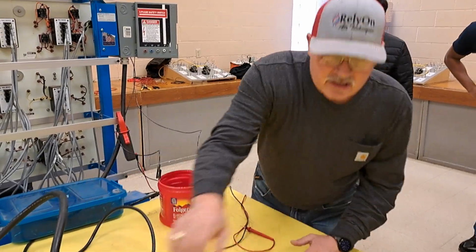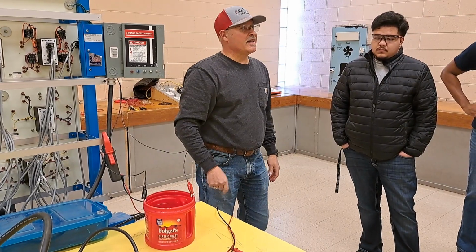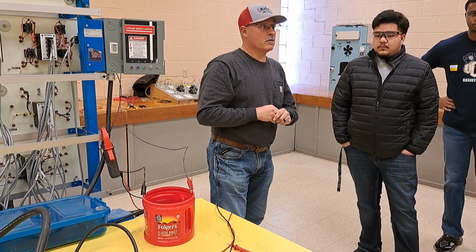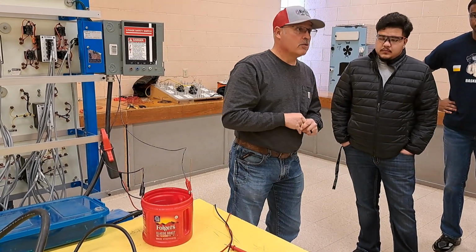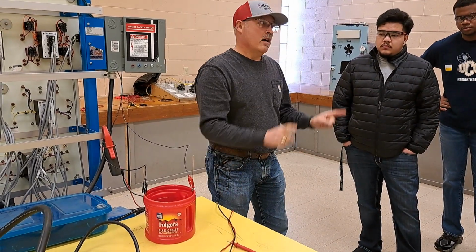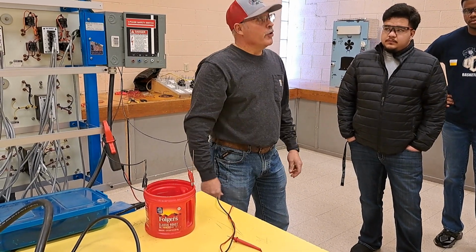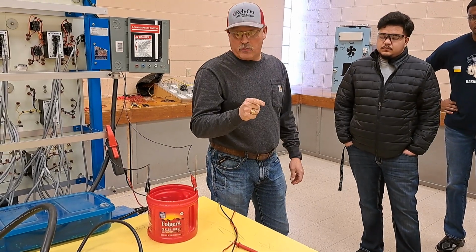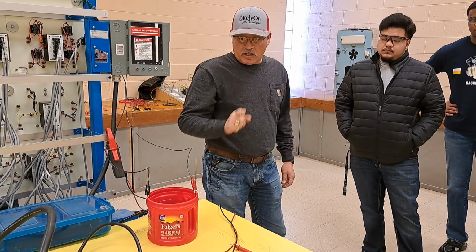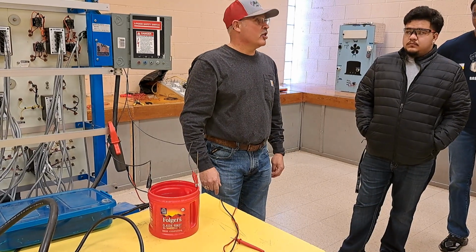Okay, so urban legend says this: water is a good conductor or an insulator. Which one? Conductor, right? Urban legend. False. Now, let's keep it safe. Being in water in most situations is extremely dangerous around electricity. But it's false. Clean, very clean, pure water is a very good insulator.